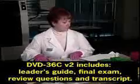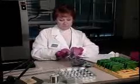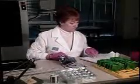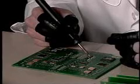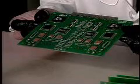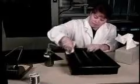Here are some suggestions to reduce the possibility of contamination when hand soldering with low-residue fluxes. The critical issue is to receive materials with a known cleanliness and solderability, and to maintain that cleanliness and solderability throughout the various processes. Although some facilities require the use of gloves or finger cots when working on the assemblies, they too can be a source of contamination. Handling the boards by the edges and avoiding contact with solderable surfaces are very effective means of reducing the possibility of contamination. Good hygiene habits like washing hands after eating can also help maintain cleanliness. In addition, make sure all storage containers are clean prior to use.